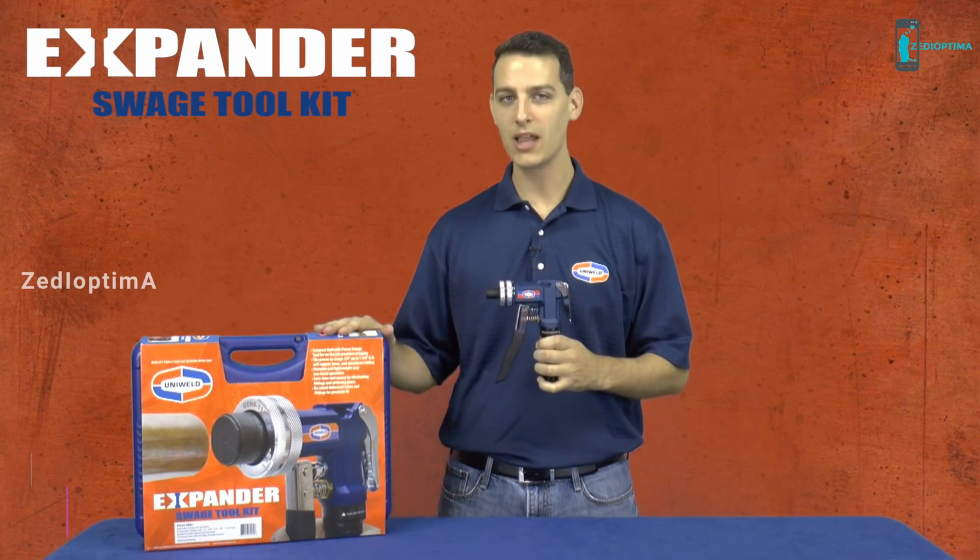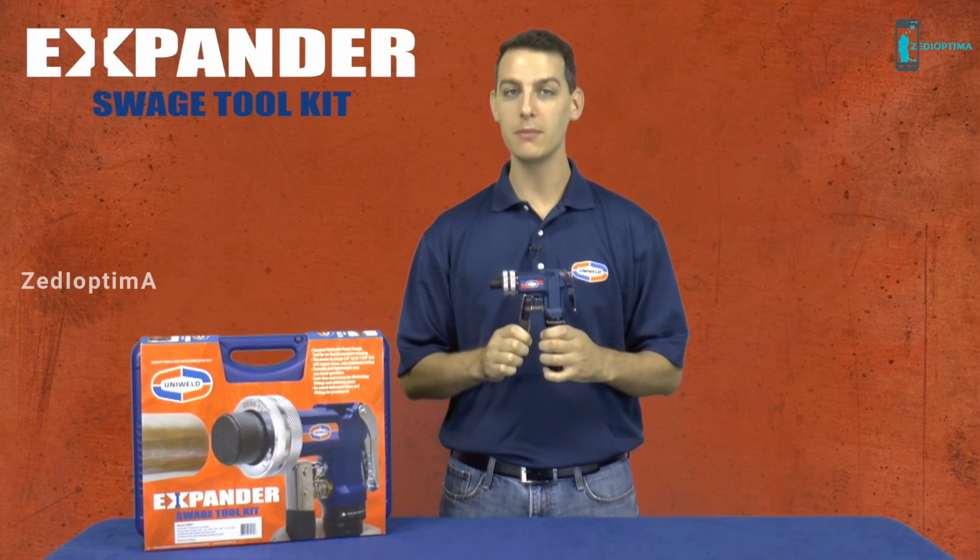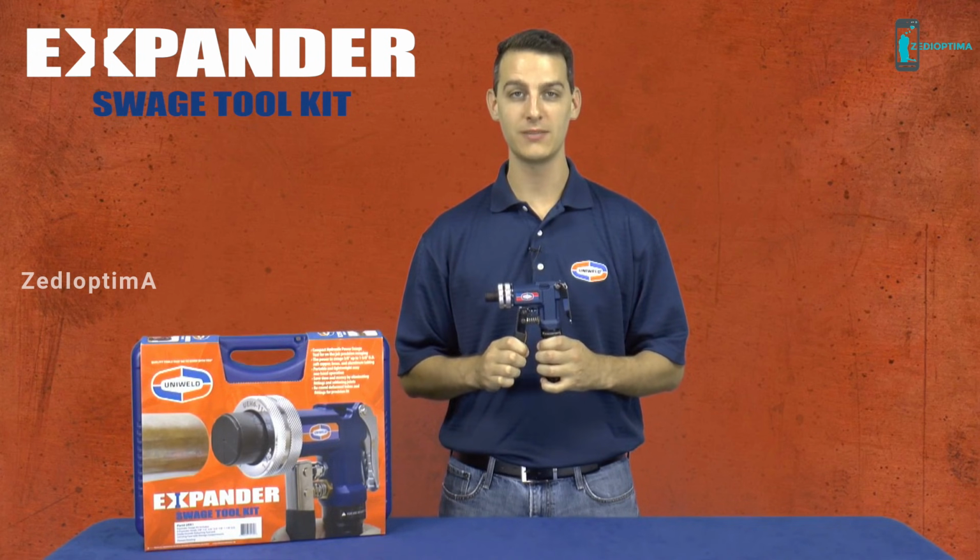This is Uniweld's hydraulic expander kit for swaging copper tubing. This tool will save you time and money by eliminating copper fittings and solder joints. You can also reround deformed tubes and fittings.